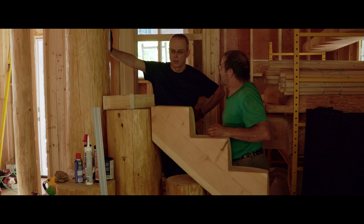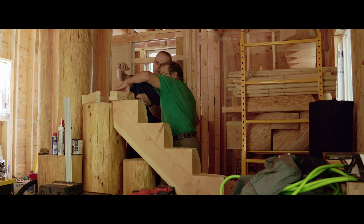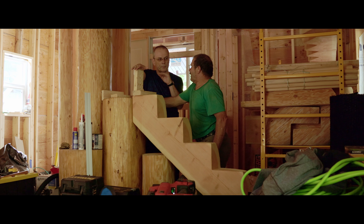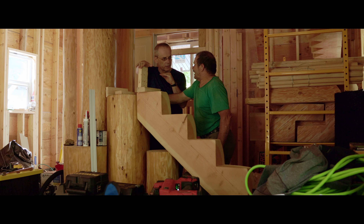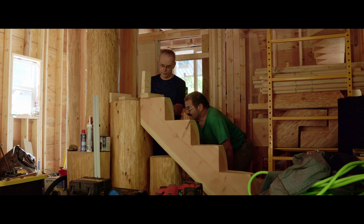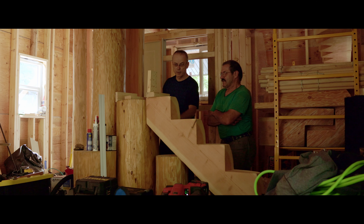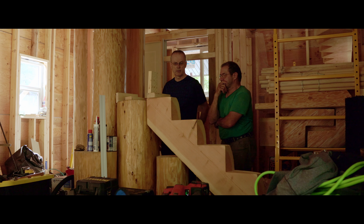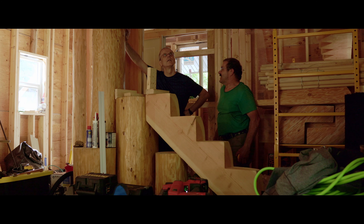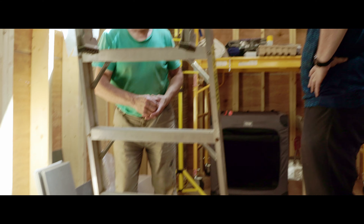Then that would go on the floor. That's 7 and a half inches — so here would be the top of the landing, including the plywood and whatever is on top of it. I thought the box would be built on top of this, in the corner of the box. That means this cannot be connected to here — this would be connected to the box. So now we have to design the thing with these extra 4 inches in mind, figuring out where we add an extra inch here and there without making the whole staircase a tripping hazard. It's quite a puzzle.